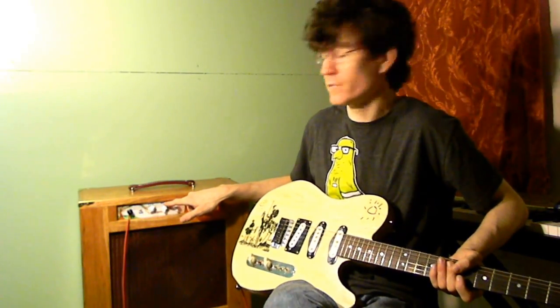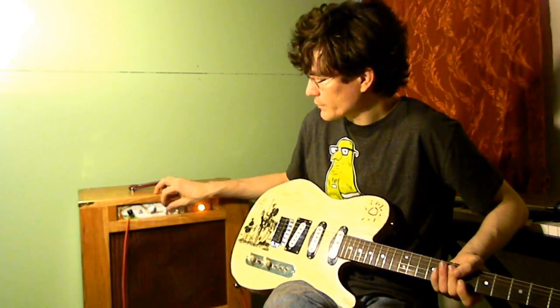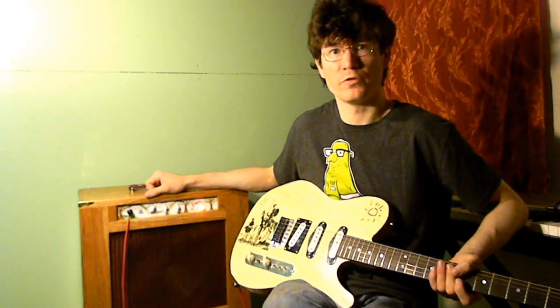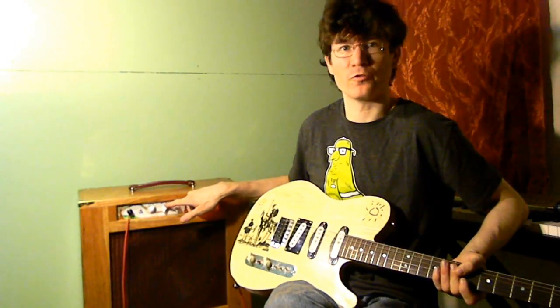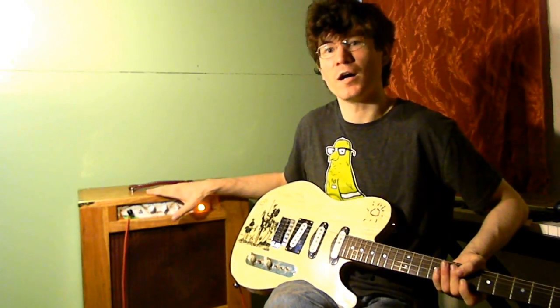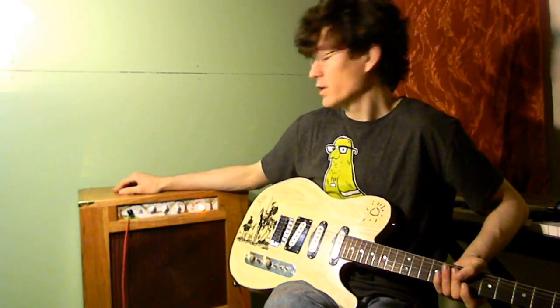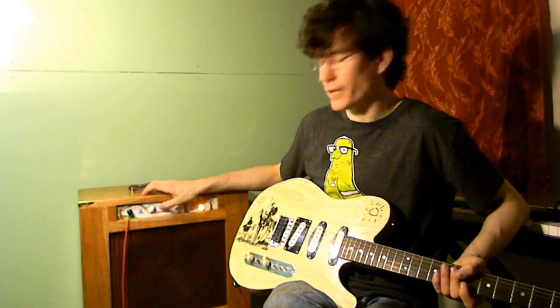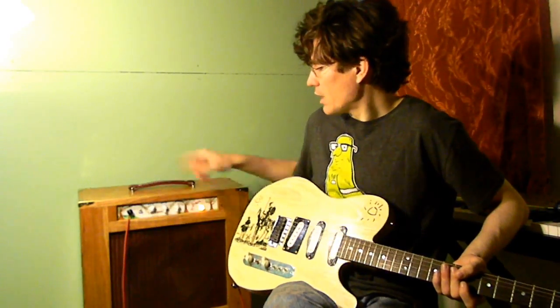Treble control is nothing extreme. It's a cut starting at about 2 kilohertz down to about 524 hertz. And it's based on Mark Hammer's stupidly wonderful tone control. Also has a little bypass capacitor trick in there so that as you turn it up, it doesn't cut the frequencies above about 1.5 kilohertz, which is nice for turning it all the way up. You get a little bit more harmonics and chime.